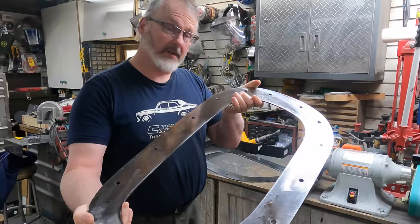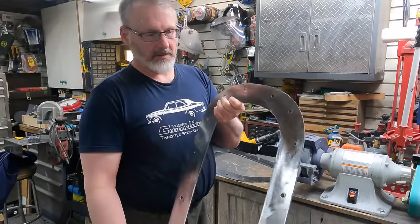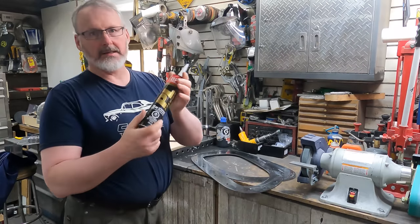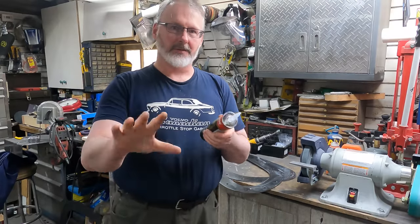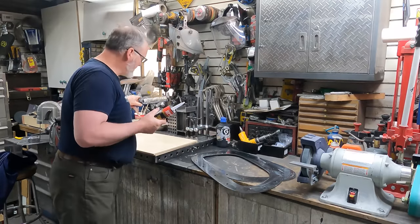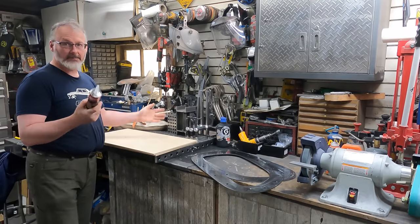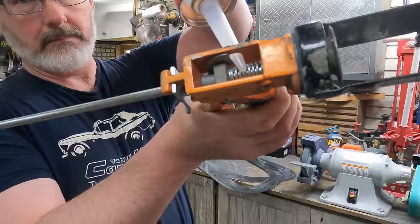All right, so with the mill scale cleaned off of these parts, again, watch the mill scale video, they're clean and tidy now, so we're not gonna have any problems with the adhesive. And the adhesive is simply construction adhesive. So we're just gonna take a little bit of the construction adhesive. We don't need to make a mess here. We're gonna apply it to the steel and then stick it to the plywood that is gonna be the spacer for this. And then we're gonna let it sit up overnight, and that's going to then be the basis for the hammer form.